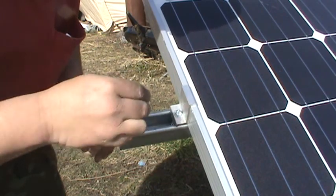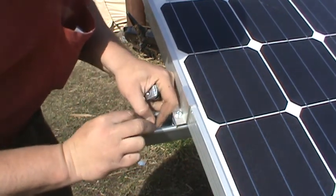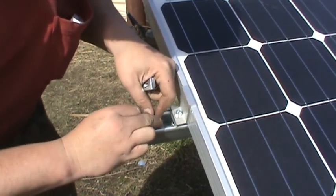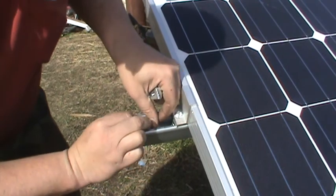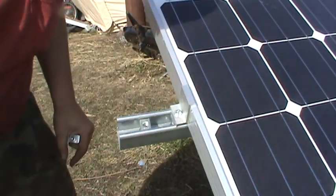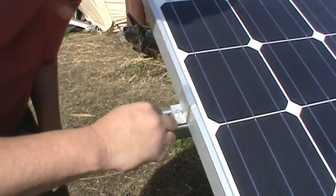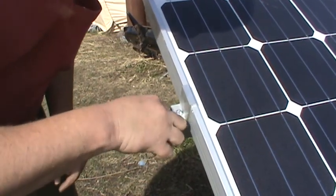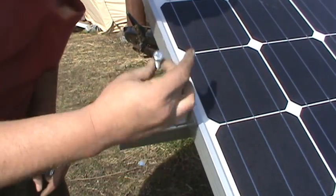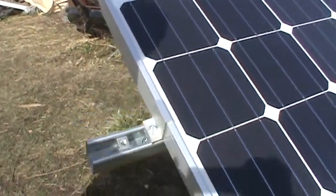With the spring nut side, put it in sideways like so, and then you turn it. Look at it - I'm turning it the way you would tighten the bolt down, because when the bolt's in there, you tighten it down this direction. Well, the spring nut locks in there the same way. And you can still slide it back and forth before it's tightened down, but whatever you've got on there that tightens down, those teeth bite into.